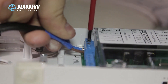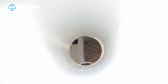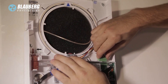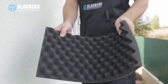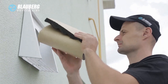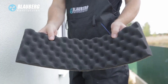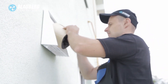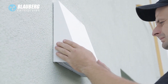Lay the power cable and perform the electric connection. Fix the power cable and signal cables with a cable clamp. After completion of the electric connection, reinstall the transparent cover. Insert the cartridge in the air duct and make sure the pointing arrow is directed upwards. Then connect the socket connector to the circuit board with the protruding clamp. Install the front part of the indoor assembly unit. Insert the sound-absorbing material from outside — roll the sound-absorbing sheet to match the air duct diameter, keeping the protective paper layer outside. Push the roll into the air duct against the stop with the cartridge, mark it flush with the air duct, remove it, and cut the excess. Insert the prepared sound-absorbing roll into the air duct. Install the outer ventilation hood.